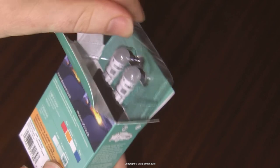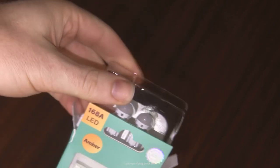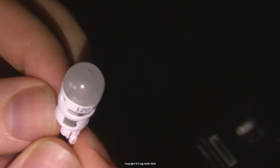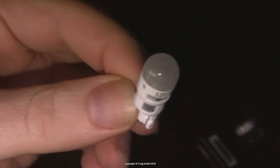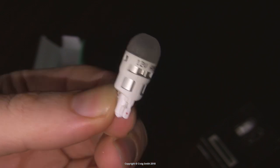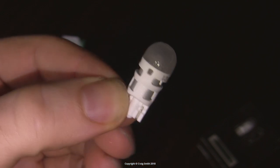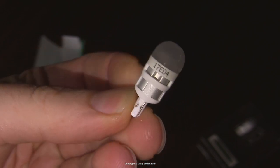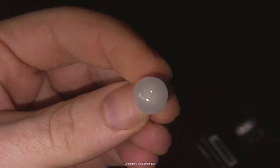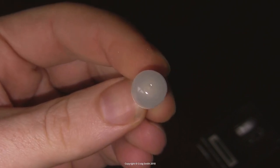Let's take them out and have a close look. They closely replicate the shape of traditional 501 bulbs, and they have this dome-shaped diffuser on the top. It's a very strong diffuser, much like their white bulbs, but despite that you need to take note that this is very much a forward-firing bulb, so it's not going to make much sense in applications where the bulb is side mounted. The diffuser gets you some side-firing light, but it won't bend the light around much below the plane of the LED chip itself.